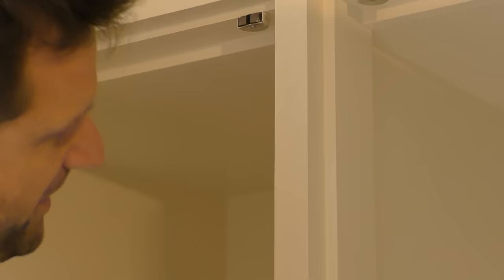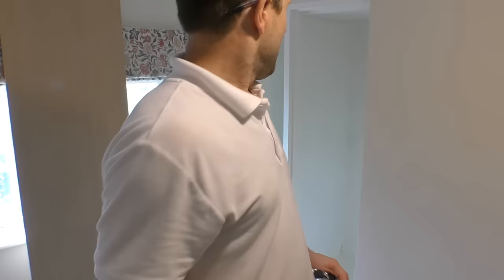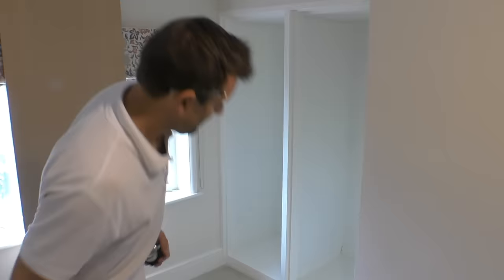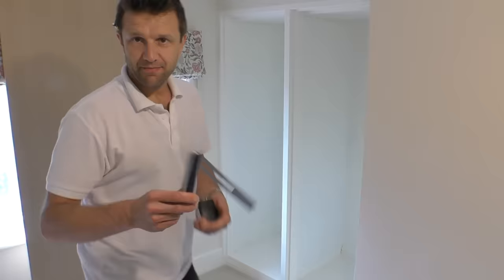First thing I've got to do is cut my base piece of MDF so that it fits perfectly into this frame. That would be straightforward if, when this wardrobe had been put together in the 1970s, they'd made the framework square - but they didn't. So I've got completely out-of-square doors. I've got to make my doors to the shape of the openings, and to do that I'm going to use my sliding bevel.